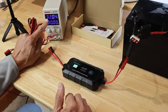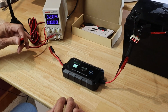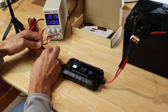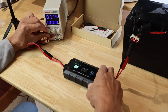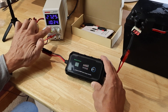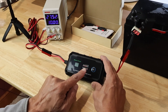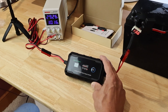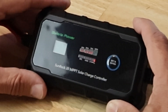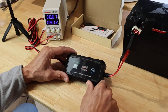I have 32 volts on my power supply right now, and this power supply puts out 10 amps. Let me turn the current down to nothing — I'm simulating a 300 watt panel right now. It's turning on, and here we go — full 10 amps. There was a delay, but it looks like the battery was almost full. Now it's charging, the 100% LED is blinking, reading 13.7 volts — so that's very accurate.